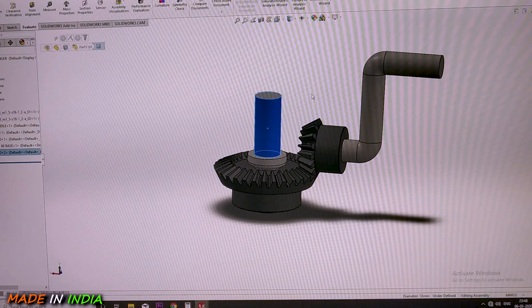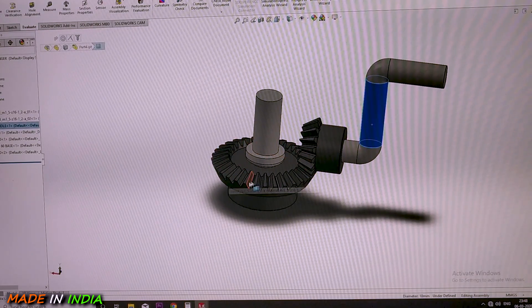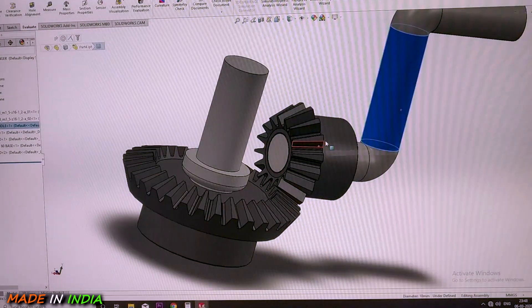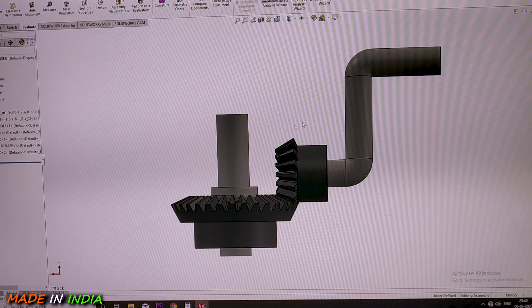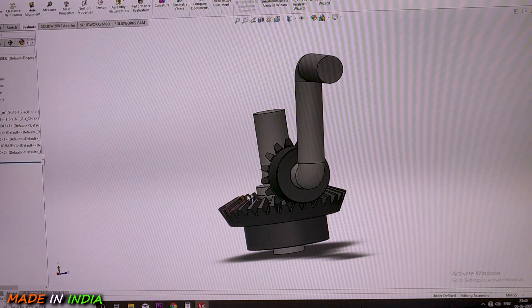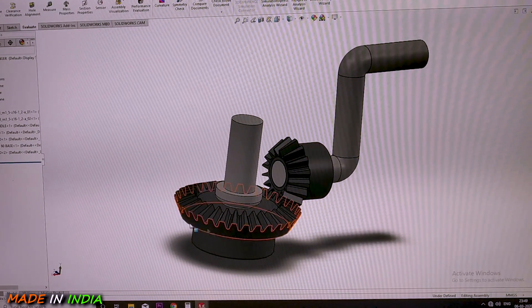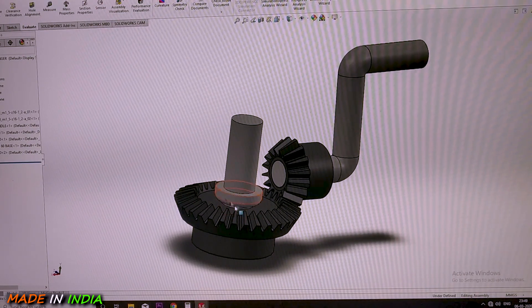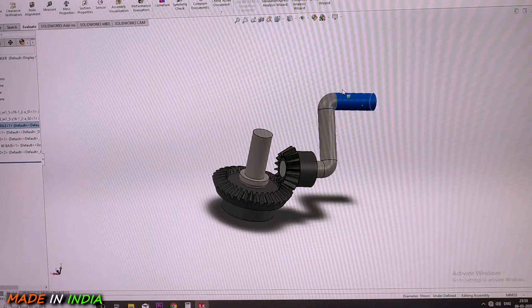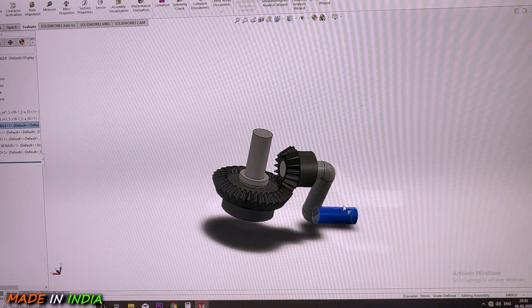If I show the box hidden, this is how the bevel gears look — the handle and shaft here, the drive wheel and the driven wheel. These are conical teeth bevel gears, meaning the teeth are in conical shape. By increasing or decreasing the ratio between the drive and driven wheels, one can change the ratio of rotations between the two, meaning the rotational drive and torque of the second wheel can be changed relative to the first — with speed increasing or torque decreasing, or speed decreasing or torque increasing.